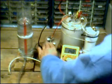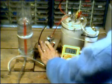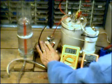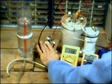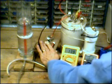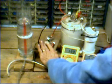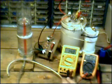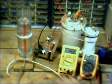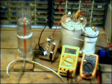Right now we're showing 14 amps. I'm going to put my hands on here and cool it down just a hair. And you see it drop — 13.9, 13.8, 13.7 — because I'm cooling it down. It's only slightly warm to the touch. I should have probably used 12 gauge wire instead of 14, but that's what I had available. It's good for making relative measurements; it's not perfectly accurate like a scientific instrument DC shunt would be.